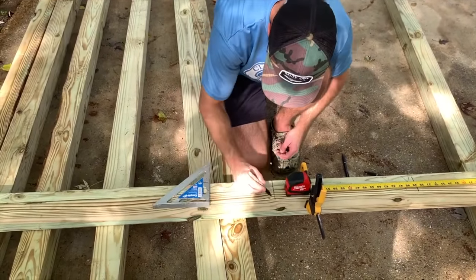Once you're pretty happy with how it looks, you're going to put in some temporary screws or nails, as I'm doing there, just to preliminarily hold it in place. Now, these temporary fasteners will definitely not hold the wall up by itself. What you really should use is a 2x4 brace that you install along the outermost wall stud and then attach to the shed base frame.